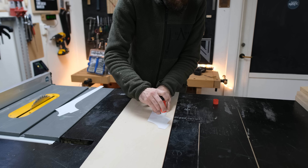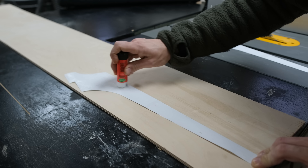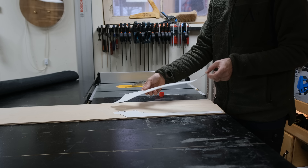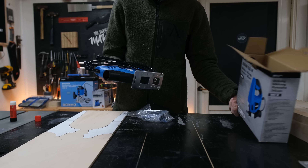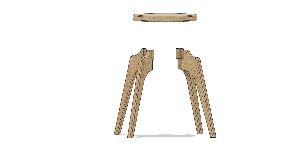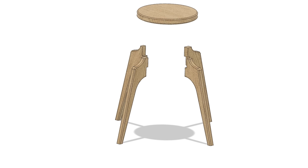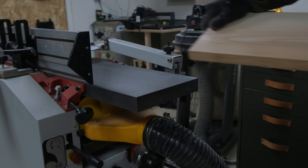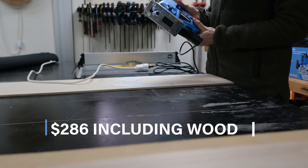The project is a stool I designed in Fusion 360, a CAD software. Since I had the plans on the computer I printed the drawing on multiple A4 papers taped together, then glued the template on top of a piece of 6mm plywood. The legs consist of four pieces — two pairs — so I only needed two templates. I'll be using ash I bought previously for around $100; the wood for this project is just a small part of it.